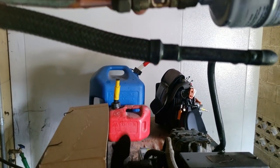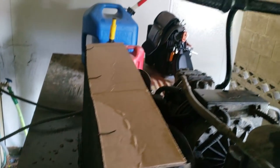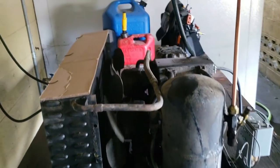So that's kind of scary. We may need to add a little more to it. We're going to let this finish drying off. But if that's showing low when that coil is wet, it means we've got to add a little bit more for the winter charge. It's going to be low this winter.